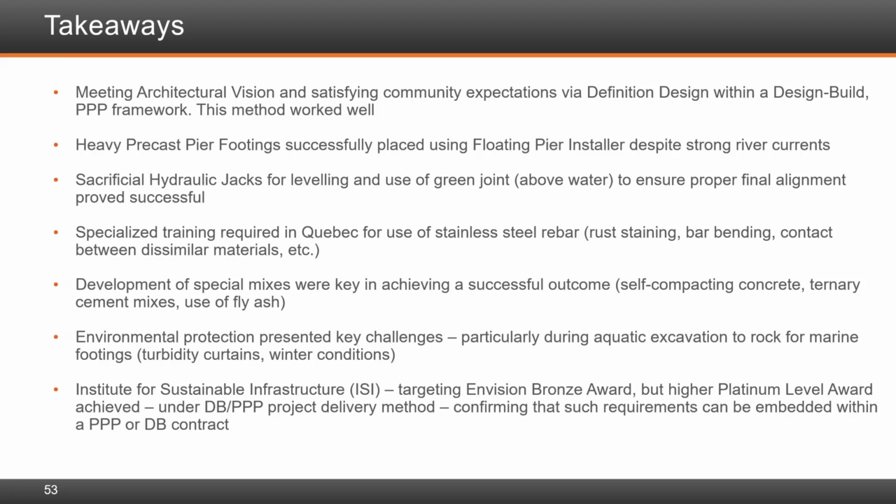Okay. I could add to that, Paul, in that in our experience also, not just Canada, when you are investing in a mega project such as this, the 75 years that is usually the design life of AASHTO is not necessarily what people are following, and our experience is that it's anywhere between 100 to even 150-year design life. And the logic behind it stems from an initial investment that the owner is putting in, and what we're finding is with very little attention to details to avoid fatigue, attention to details to address drainage, some investment in terms of better quality concrete, or like Guy mentioned, stainless steel, you wind up being able to extend the design life of your bridge from 75 to 125.